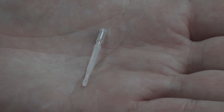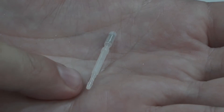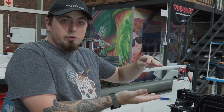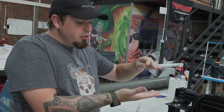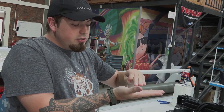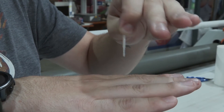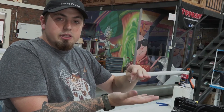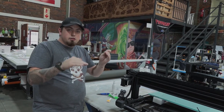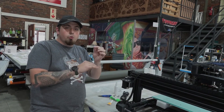The last item in our kit is the CR touch arm. What this does is sit on the inside of the machine — the bed and the printer automatically level themselves using this component. It goes along the bed, does a little touch in one corner, then moves to the next corner and repeats, covering all four corners and the middle, then calibrates the head so it knows the bed level. In case you accidentally snap the plastic tip off, you've got a spare, which is very important because without this your printer will not work.